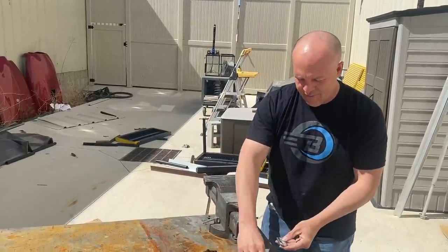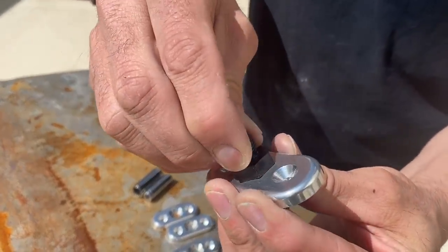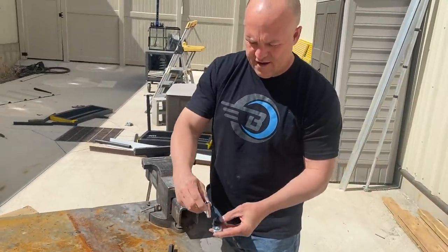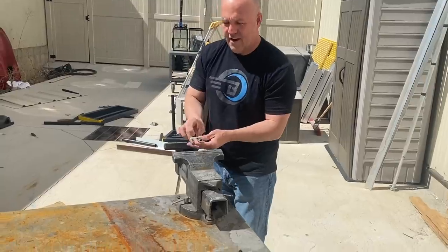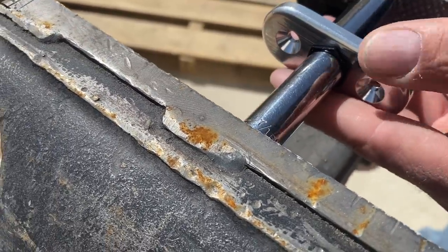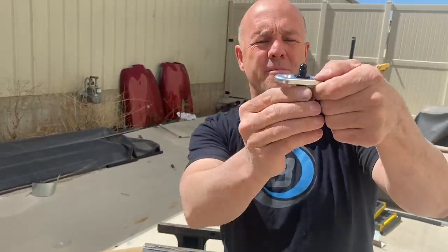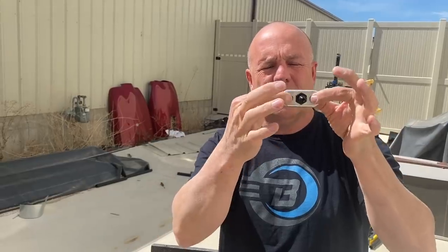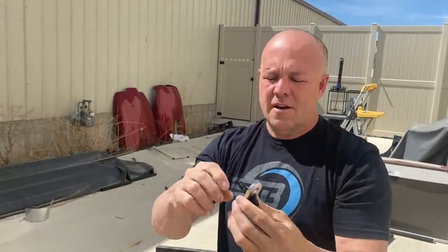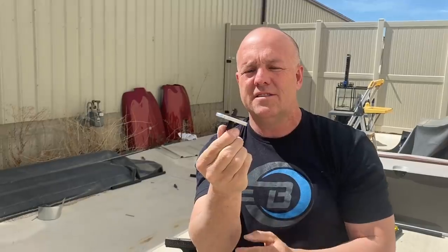So I made these. I made them so tight, they actually don't fit in. If I've done it right, put this socket here. This socket here, press fit. Now that can't move, can't twist. Once this gets screwed to the firewall, bulkhead, whatever pass through, I can still put the nut on the backside. The hose can connect here. But once this is bolted, I can put a wrench on this side or this side, and that head can never move and I can never get the other side to come undone.